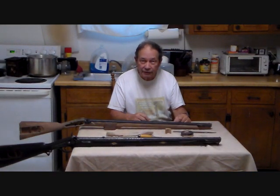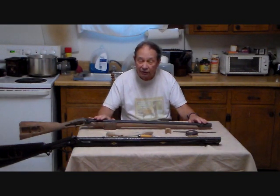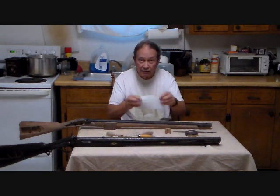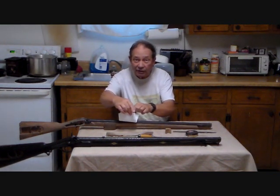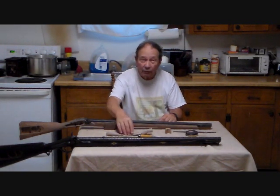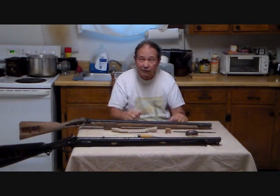Now for some tips on how to do the details. This is black shoe polish, and that's what I used to coat the underside of the barrel and the barrel lugs so I could see exactly how they were bearing and where the high spots were, so I could whittle away a little wood and seat it all the way down. And paper — you put this underneath the barrel between the lugs. You can also feel along the barrel channel back and forth between the lugs, see where it's hanging up, and see where you need to remove a little more wood.